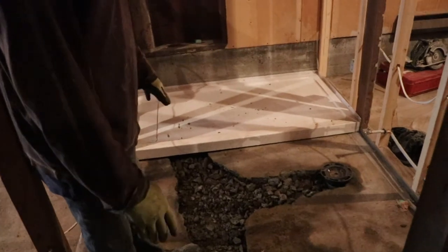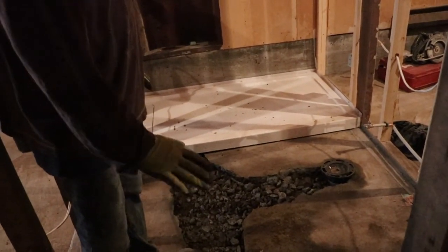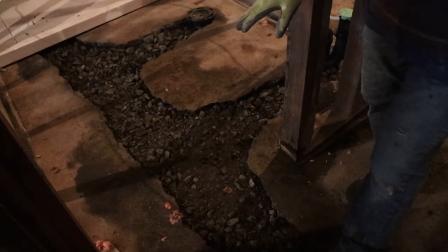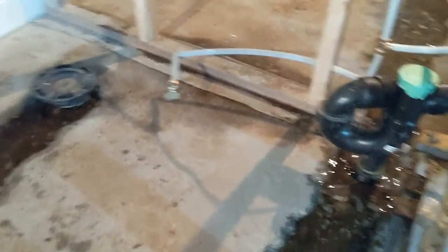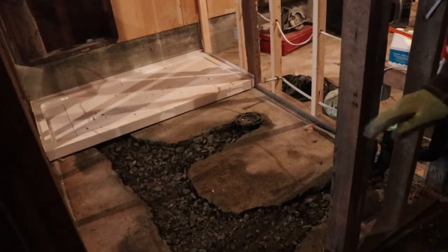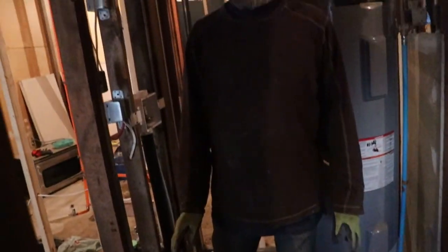All we're doing here is this area wherever we broke to do the plumbing and the pipes — filling underneath the shower base to give it extra support and filling this hole. To compact it we use water, filling this with water and we compact using a 2x4 and stuff like that, just not to go too hard on the pipe, because if you don't do that this thing will shrink down a little bit. So this one is pretty much compact.